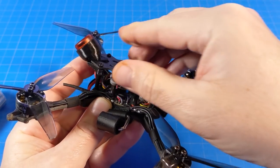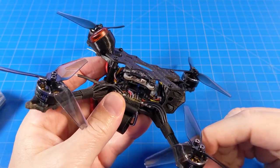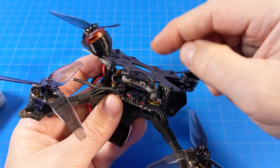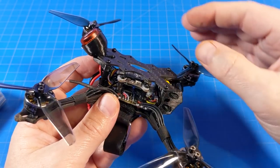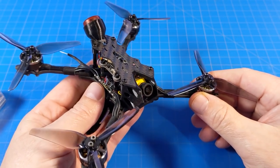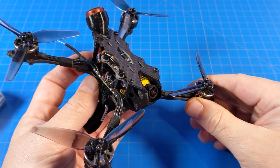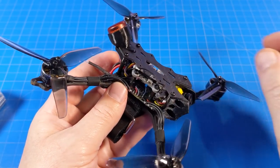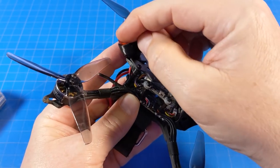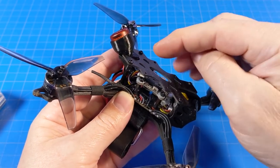The Rush Cherry antennas are very popular and durable on quads. In this case, they don't have a stem — it's just the wire with a UFL connector — keeping things very light, which I think is one of the goals at 3.5 inches: get as much quad as you can and still stay under that 250-gram limit that will eventually be imposed, at least unless you have a Part 107 license. The TPU print at the back holds the antenna nice and securely; through my crashes and flights it didn't move at all.